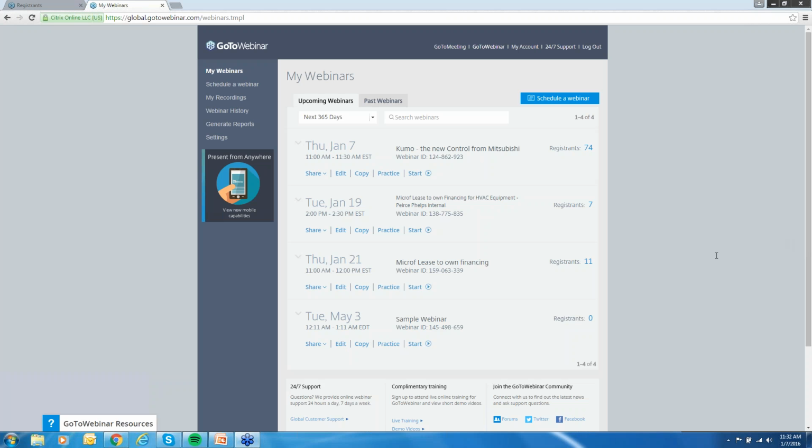This is a follow-up to that question. I see we have a follow-up about other metrics on runtime, energy consumption, etc. At this time, the answer is no. We do not have access to such information. Is this compatible with GE and FH models? Yes, it certainly is. It's compatible with MSZ-GE-8 and MSZ-GE-9 models, as well as all FH models. It would not, however, be compatible with GE models prior to the -8 series. As long as they have an NA-8, the model will be functional.